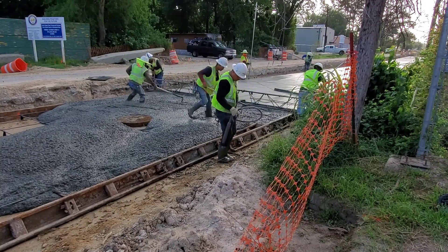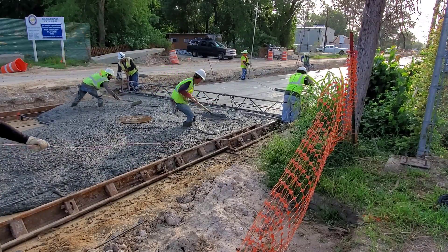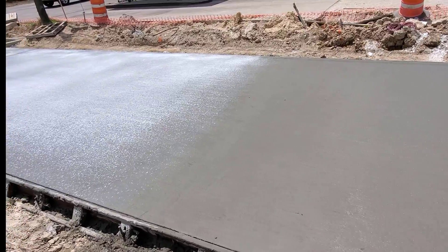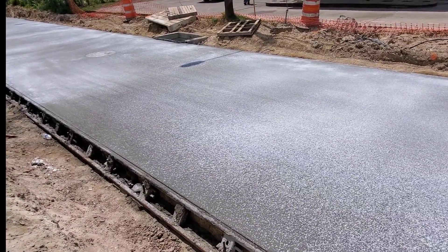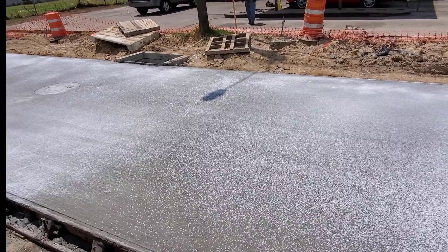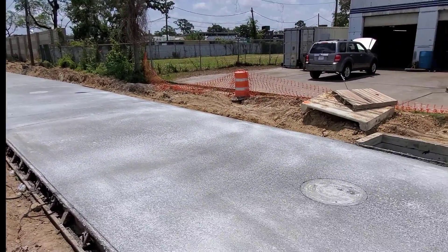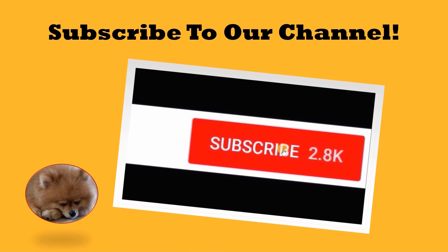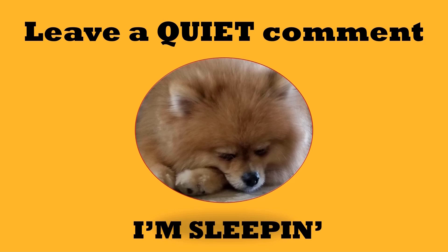Here's another shot of the screed and how it looks behind it — a couple of guys finishing the concrete. This gets a burlap drag finish. The white stuff is a curing compound designed to keep the concrete from drying out too quickly; concrete cures by hydration, so it holds the moisture in. There's a manhole where they started at four o'clock this morning — that's a Type C manhole. I hope you enjoyed the video and this answers your questions. Leave any questions in the comments — thanks for watching!